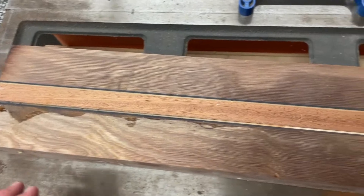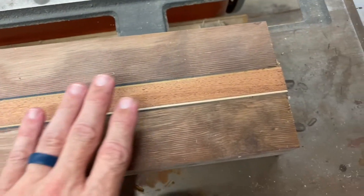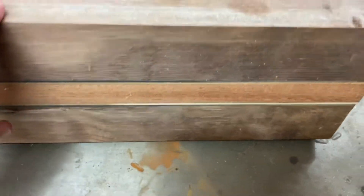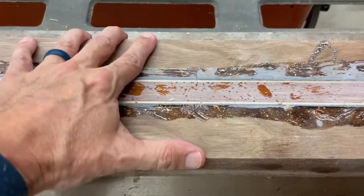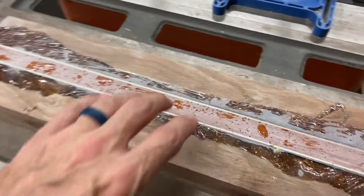Right or wrong, I don't know - this is my first one, still learning. What I did is I got this side sanded down, but it still isn't smooth - it's got a wobble to it because of the epoxy buildup. Once I got it pretty close - because I didn't want to shave the block too much since I know I have excess to trim - I ran it through the planer. Now I've got a flat surface, it doesn't wobble at all. I'm happy about that.